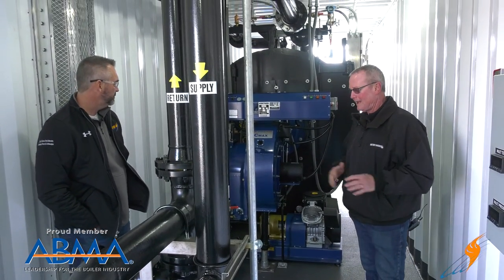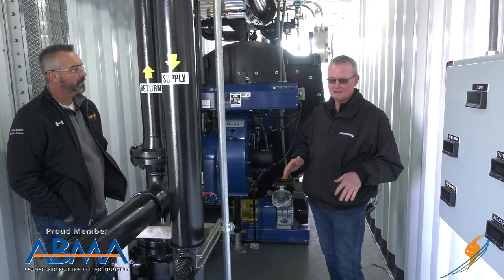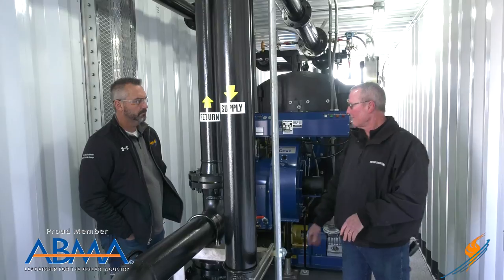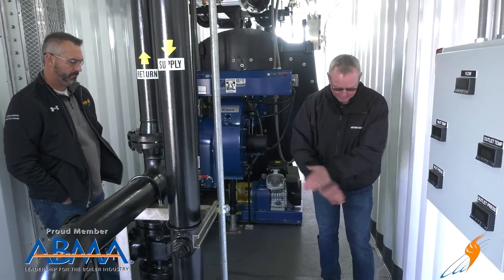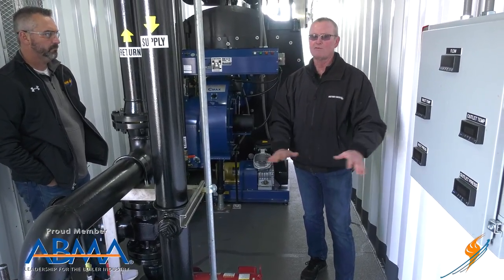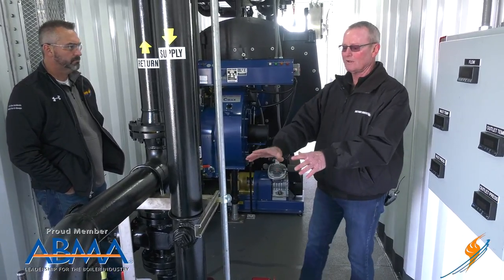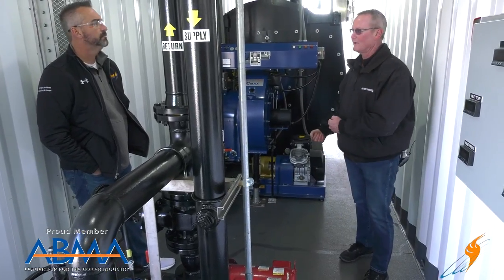The thing they had on the original drawing that I completely changed for them is they had the piping running down the wall, across the floor. The pump was on the floor, the air compressor was on the floor. Because the pipes were running crossways, it was a safety hazard. They built a false floor in the trailer over top of it, so you had to walk up over top of it to get wherever you were going. And then to work on the stuff — to get to the valves, the pumps, everything — you had to take panels off the floor to get to it.